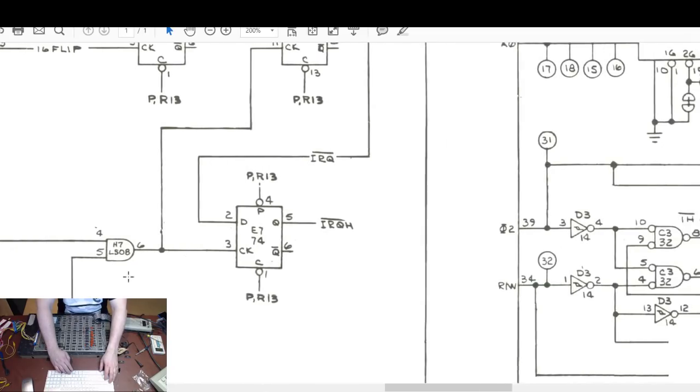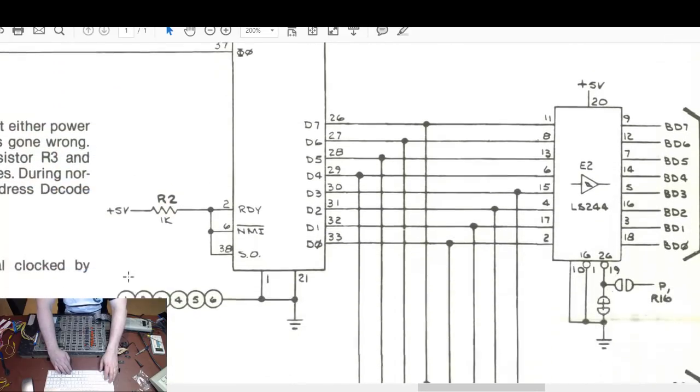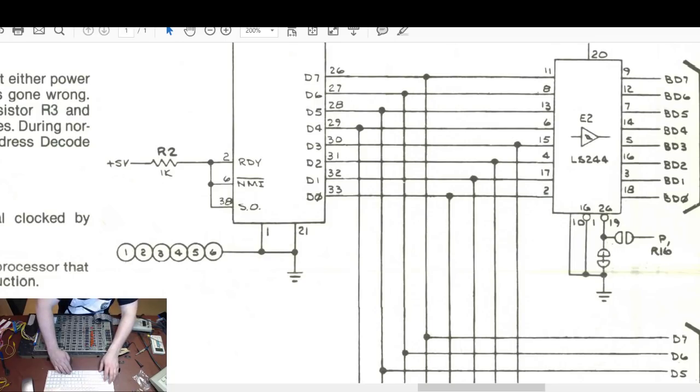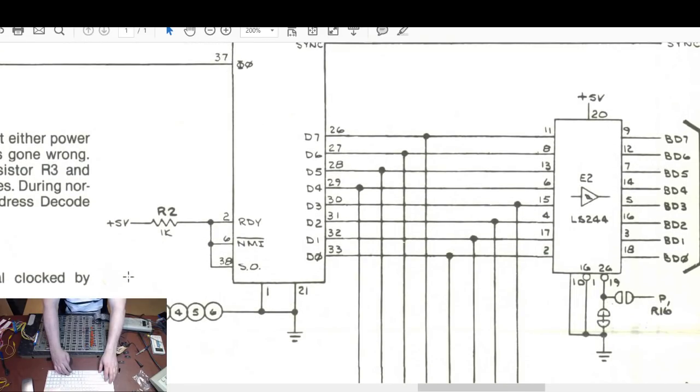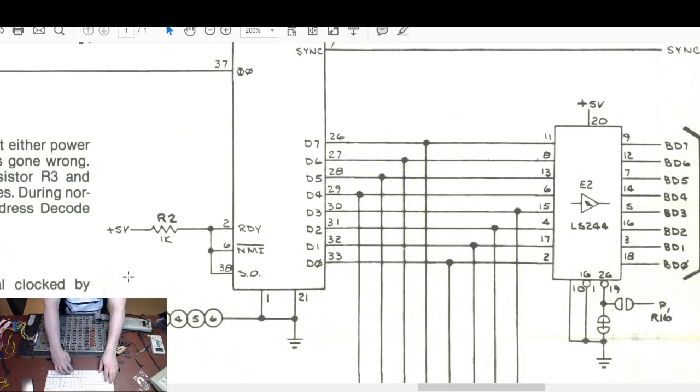So I think the sync chain's probably all okay. So we are back to, is that the E2 one? Don't know. No, that was the BC one, mate. Watchdog shouldn't be doing anything. It should be ignoring it. So it says okay. Then you do a bus test again. Read sysctl. When I read the system control, there's one bit that keeps changing. Alright.